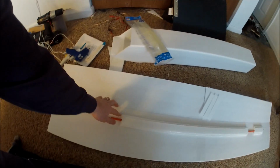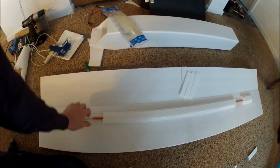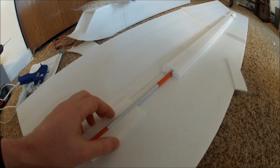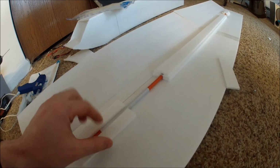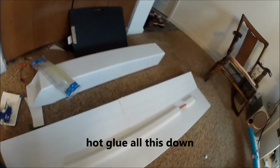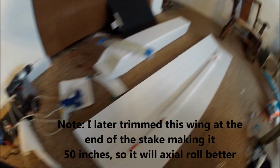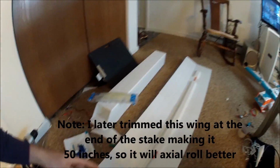So this is how I make a wing. This is two pieces of foam board that I cut before. Come back 1.5 inches in the fold. And then the layering method is when you use one of these big sidewalk stakes, go 4 small pieces of foam, hot glue those in place, and a top cap on it. And that's essentially what this is. I have to do the main spar across the center, one big piece, and then 2 ends to hold it, since there's no foam long enough to do the whole thing. And that gets pretty much to the end of the wing.